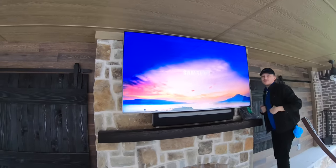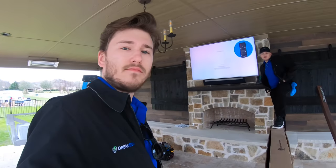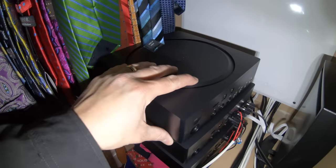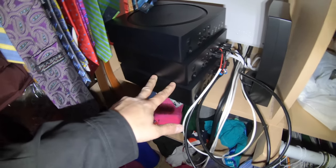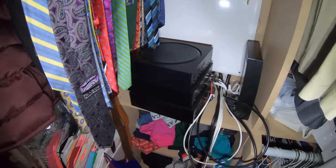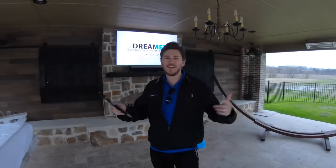If you're going to put a TV outside, at least the QLED is nice and bright — not as bright as a true outdoor TV, but it's affordable and bright, can't beat it. Here in the master closet smart panel is where we're keeping all of the Sonos amps. This one is coming from the first set of rock speakers, this one is for the second set of rock speakers, and this one is for the all-weather speakers mounted under the eave. Everything is hardwired into the router — these are 125 watts a channel, the Sonos Amp, and they'll integrate in with the rest of the Sonos network.